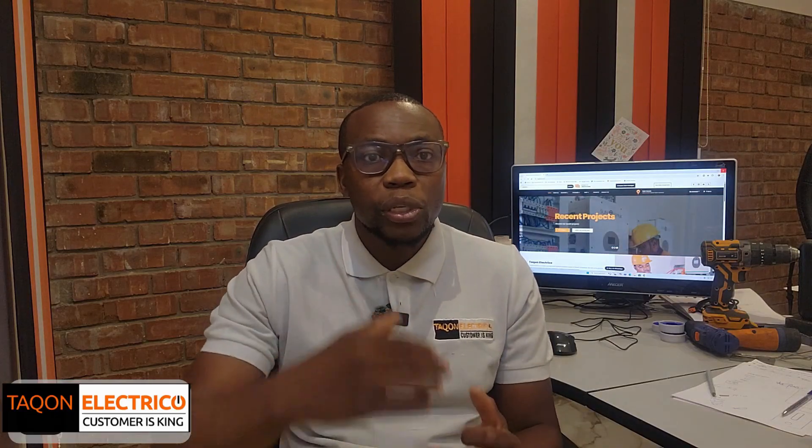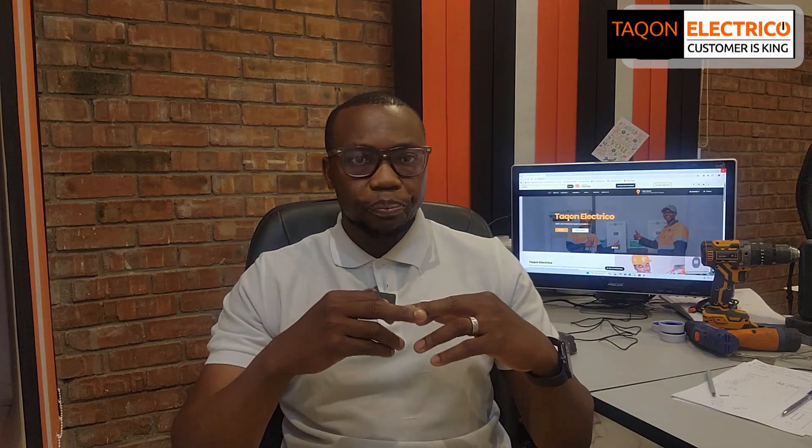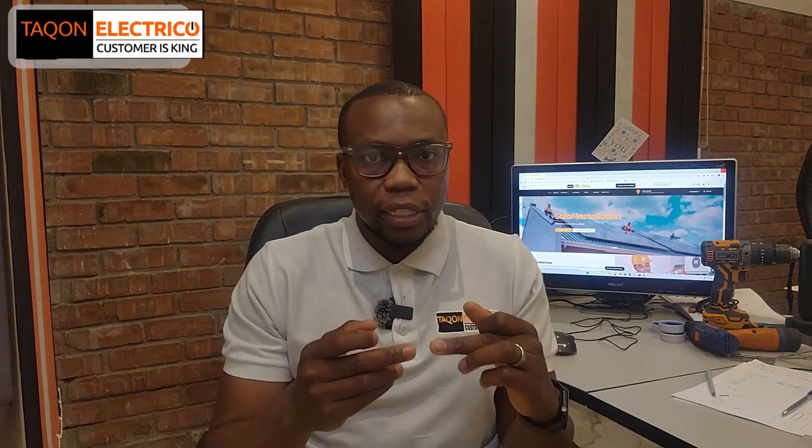A small car with a small engine will struggle to tow a trailer — in the same way, a low C-rated battery struggles when you try to power heavy appliances. If you are running heavy appliances like borehole pumps, welding machines, heating elements, booster pumps, or power tools, you need a higher C-rating battery. For lighter appliances like lights, Wi-Fi, and TV, a lower C-rating battery is usually fine. For example, a 100Ah 48V battery rated at 1C can continuously give 100 amps, but if rated at 0.5C it can only give 50 amps — the 1C battery is stronger and usually more expensive.